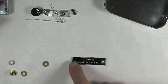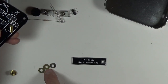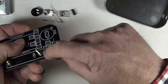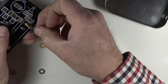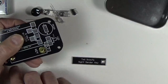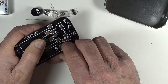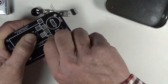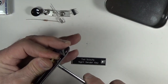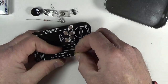Then we'll go with the bigger number six screw from the bottom. We've got three washers — there might be a slight size difference in holes, so go with the two bigger holes first because there's a little shoulder sticking up out of the board. Then the third one: this is called a knurled nut. Put that down, then get a screwdriver, tighten it up, put the key down on it, and put the nut on it.